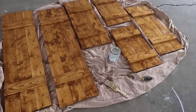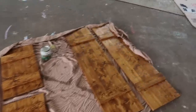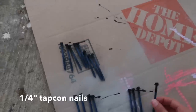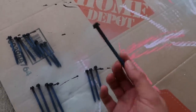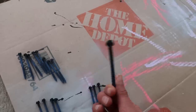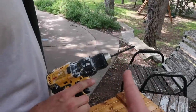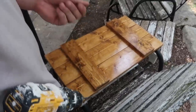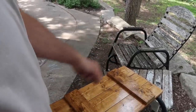These are all dry. These are the screws we're using to put into the brick. They originally were blue and Trey went to Walmart and bought a cheap can of spray paint to spray paint them. You're going to take a drill bit the size of your screw and basically just drill a pilot hole so that you can take your Tapcon screw — or whatever you're using — go through the wood and secure it into the brick.